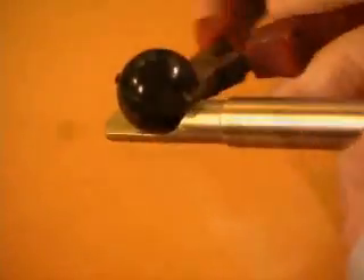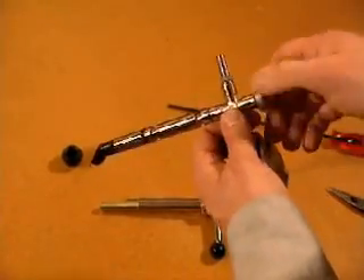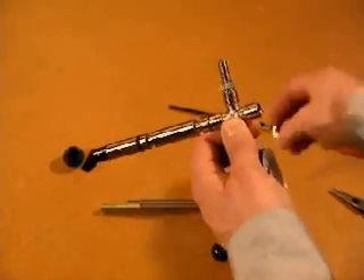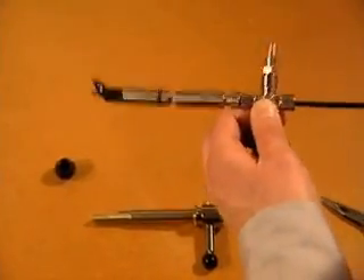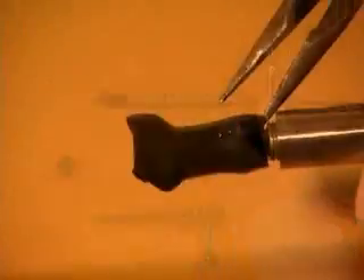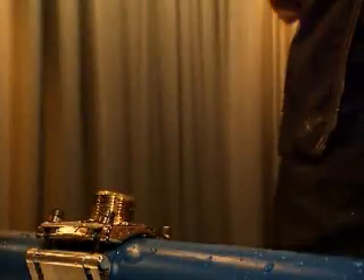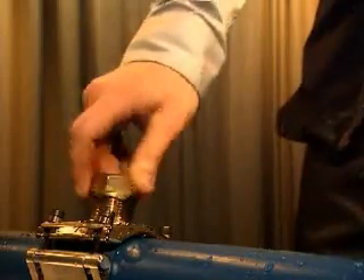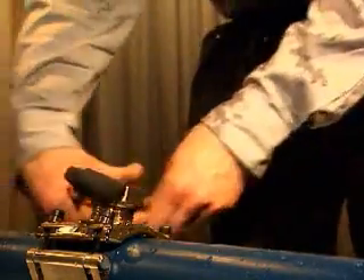When you've removed the balloon, cut it away from the balloon holder. Hold out the stop ball and withdraw the balloon holder from the support tube unit. Loosen the balloon holder plug and unscrew the balloon nipple with the hexagon screwdriver. Carefully remove the remains of the balloon. Unscrew the adapter when the blocking device has been removed. Finally, fit a cap to the neck of the clamp. The job is now complete.